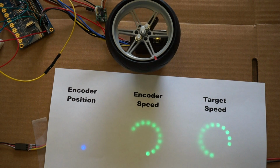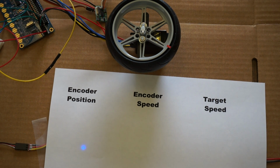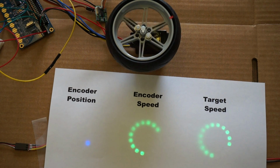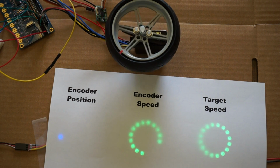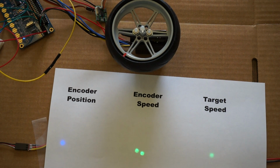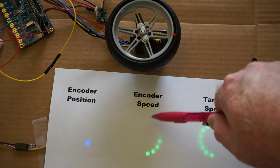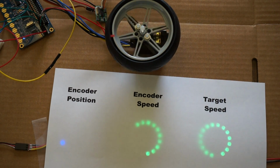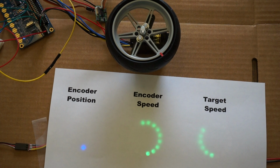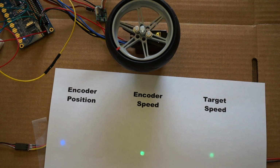And so hopefully one could have the servo move at a constant speed, monitor that speed, and then create a table of adjustments for the speed at different positions. It'd be great if you could very precisely manufacture a magnetic housing, something to hold the magnet over the encoder, where you get very precise feedback on speed that would be consistent as it moves. I'm not sure if that's possible or not. And so an alternative would be to come up with some sort of calibration table to correct for the speed at different positions. And I'll just let that go through a couple more times.